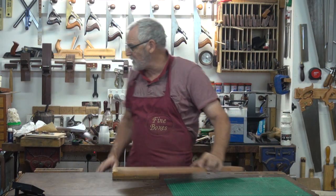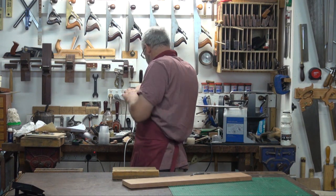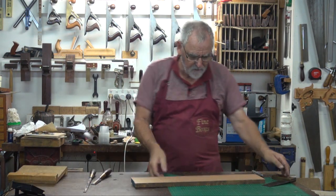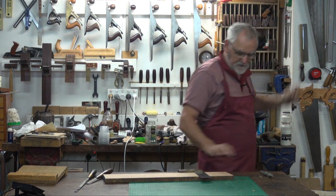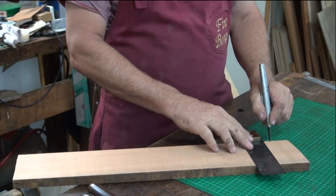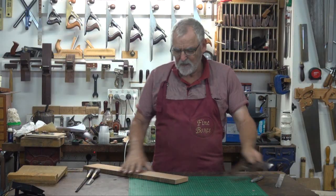All you need is a knife, a chisel - I'm going to use a paring chisel - and a square. Make sure you've got a straight edge. Mark out where it is you want to cut. So I might say I want to cut 50mm in from there. Put your knife in the mark, then move the square up to the mark like that and give it a score. A couple of scores if you're feeling good.